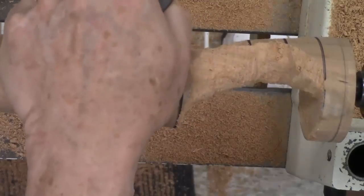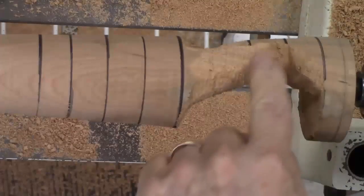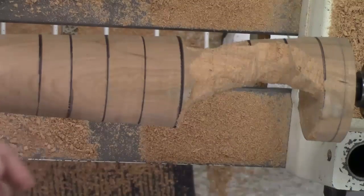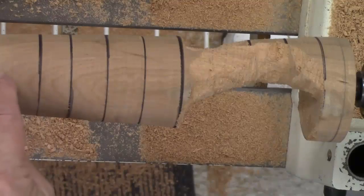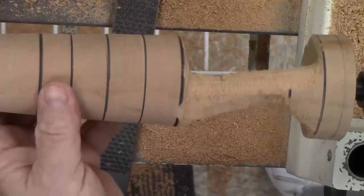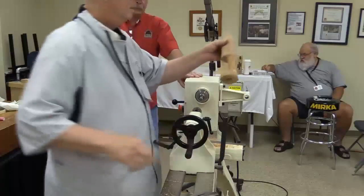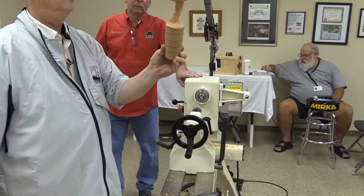Now, you can tell I'm getting near the middle there, so I'm going to start watching how much I take away from there. Although as I would move on down this way, simply because it's not doing the orbit down here - standing from the central point - it's actually going to move inside the surface line here. And you can see it begin to take shape - it doesn't look as ragged as it did. It's beginning to get some circular form to it.